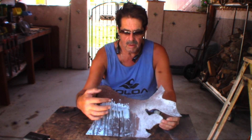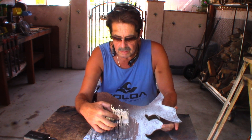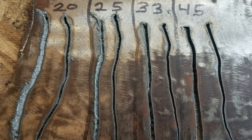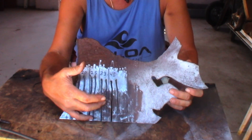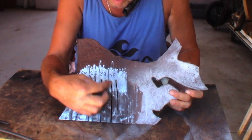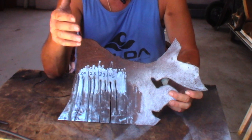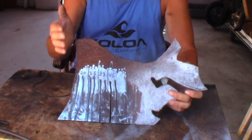At 33 amps you can see here's the 33 and here's of course the 45 — it didn't do too bad. When I got over here to 25 amps at 110–115 PSI, it made a nice clean cut, not a lot of slag or buildup. Same thing on the 33 and the 45. A couple of these got a little bit wider kerf — not a big deal for sheet metal or artsy projects, but it could matter if you're cutting angle iron or thicker steel.